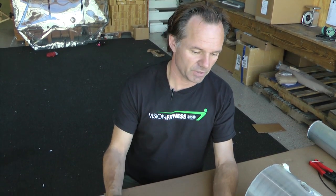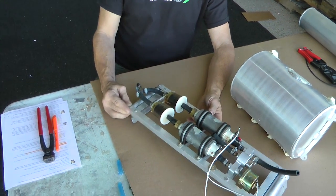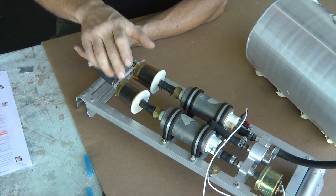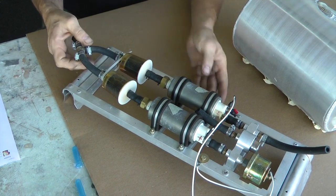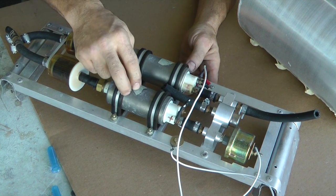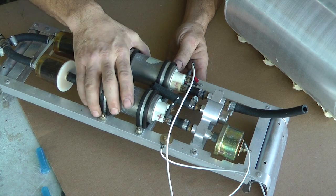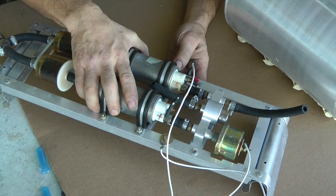This is what's been used for several years — Viking used this system as well. Basically you come off your wing tanks, tee them together, and then feed two pumps individually through these external filters. This will be the low pressure side. These are fairly heavy-duty, high-draw amperage pumps — six to eight amps apiece — which is a heavy load during dual pump operations such as takeoff and landing.